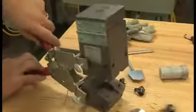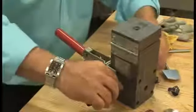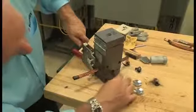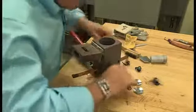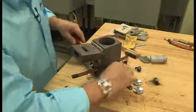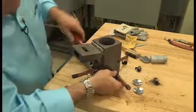Next thing, we'll open our clamps so that we can position our cables. This one I'm going to actually have two different cables meeting in the center and then one tapping off. And you don't want to have them perfectly touching because we want to have the molten metal fuse between. So I'm pushing it in until it touches and then backing it off at about 1/4 inch.